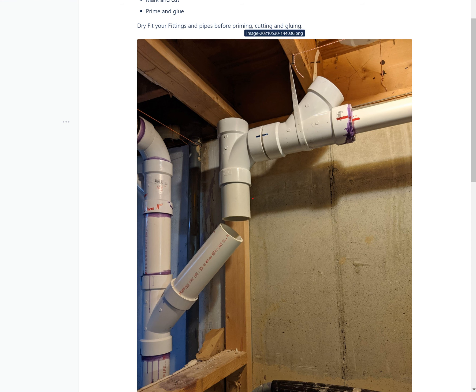Let me also show you another picture. So this is how you measure this — you can make your cut for that pipe right there. You already align this connection to this one, so they are aligned. This is sort of like how I dry fit it. Notice that you have to use some support here as well to make sure that it doesn't fall down. You may also have a string here that tells you your orientation, the slope that that pipe needs. Don't do this unless you know about slope and things like that for every pipe.